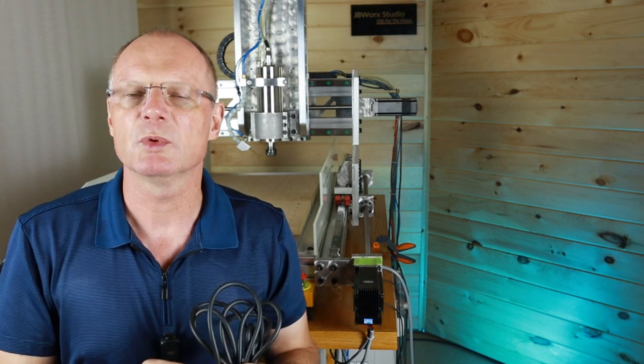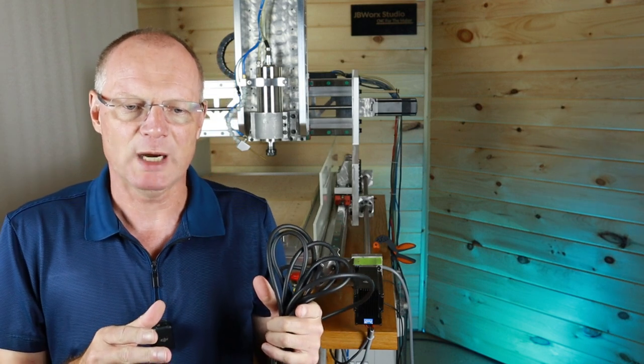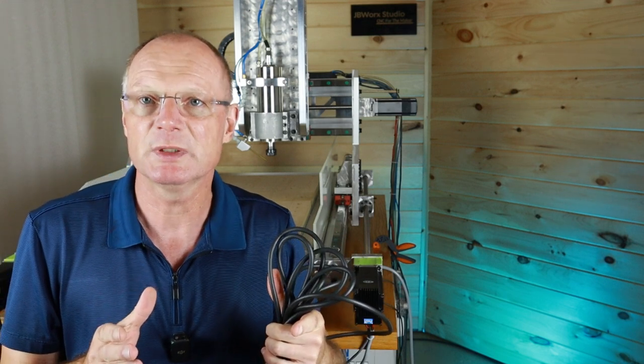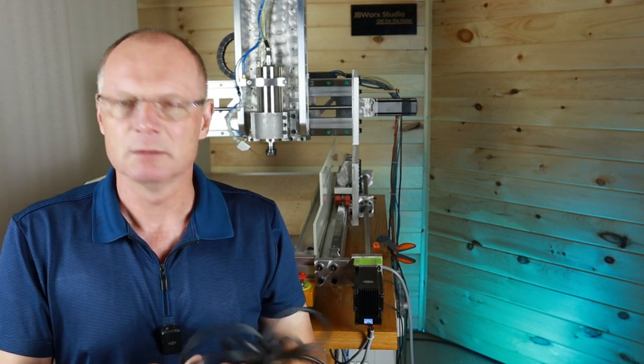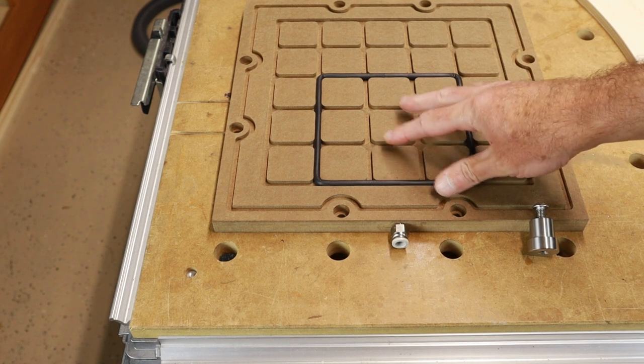The optimum really would be that when it sucks down, it would be on the flat plate. Let's say if it's MDF, like in my case, that your part actually has contact with the MDF plate. The force for uplifting is pretty good normally, but for shifting the material left to right is not so great. And when it's in contact with the plate, then there's friction, and that will also keep the workpiece firmly in place.